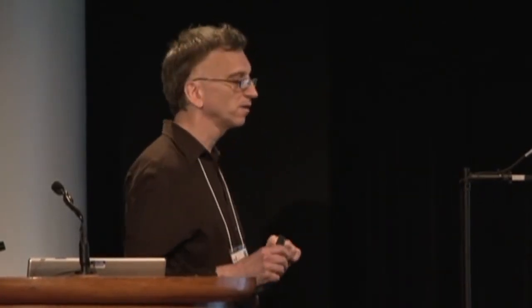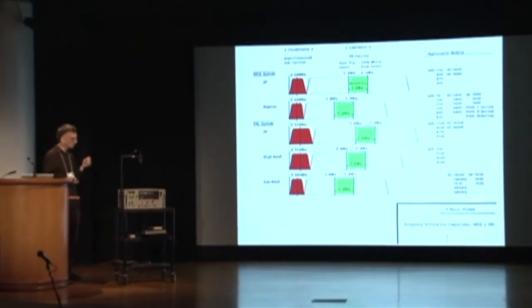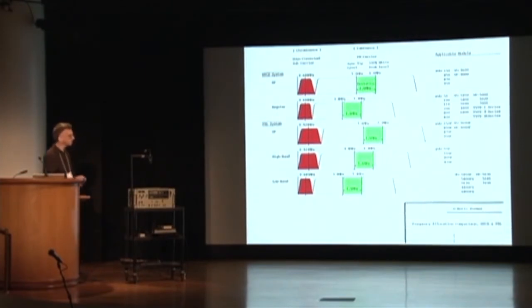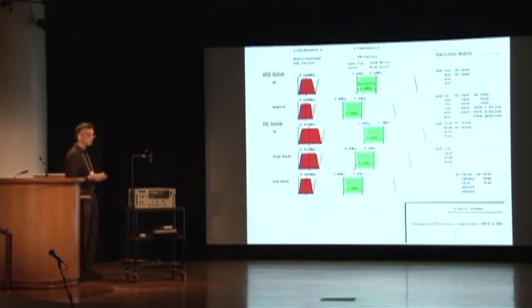Same thing within the world of video. The difference is that here we're taking a spectrum of space, and the chrominance here, which is in the red, is, think of it as recorded on one station or one channel in the RF world. The green is the luminance section recorded on another channel. So you have one channel for the chrominance, one channel for the luminance. Again, think of one station on your receiver for WCBS, and another station on your receiver, WNEW: two different frequencies, two different pieces of information. Same thing happens here in the tape world.